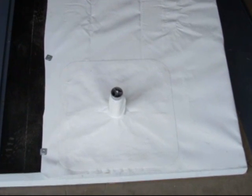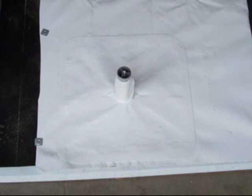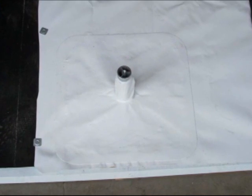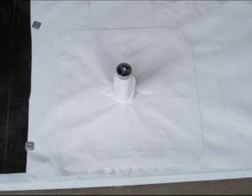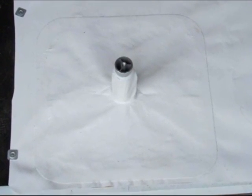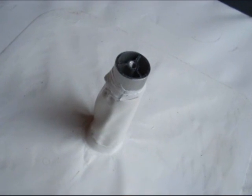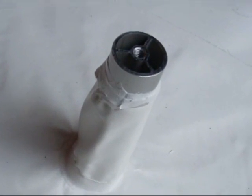Clean it off with acetone and you get a factory boot to go over it. You're double-blind caulking this — fill the inside of that boot with silicone or caulk. Make sure you use a manufacturer's product because we're having compatibility problems. Then you put a stainless steel band around the top to seal it.